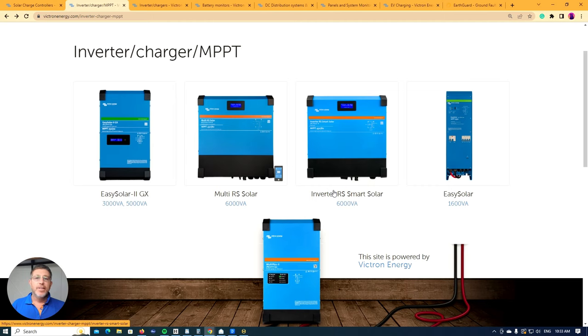From a programming point of view, you tend to use the Victron Connect app and connect through it to do anything locally. The Victron Connect app actually has a lot more features and functionality than VRM locally. You can also use it remotely from your phone or desktop. These newer products can be configured entirely from the Victron Connect app — you actually don't need VE Config files or to log in with a laptop.